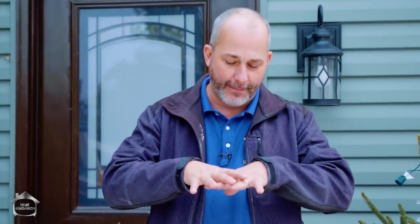Now, I want to just give you a little bit of information. If you are in a northern climate and you're going to have a hot table in a cold space in the spring and then fall, you've got to use a wire mesh inside your cement mix. And you've got to make sure that every 6 or 8 inches is meshed and linked together, okay? Because there's such a huge amount of heat that's concentrated, and when you use the glass, it really holds the heat down the middle of the table.